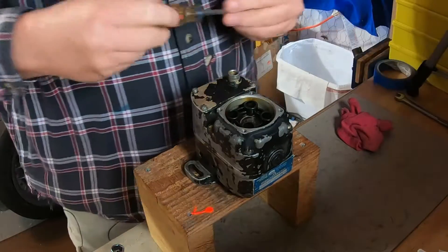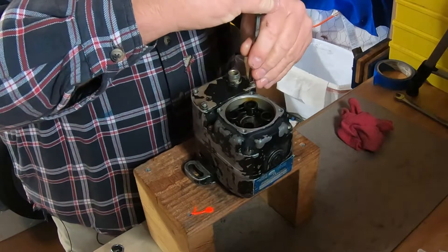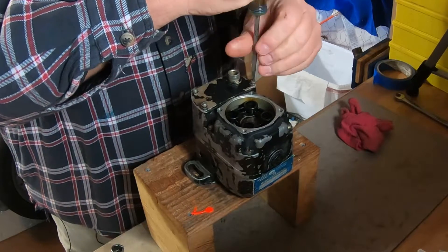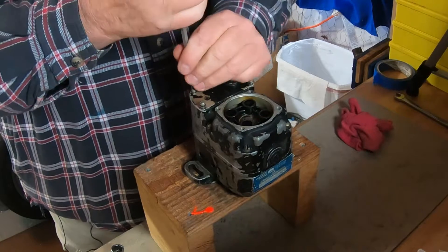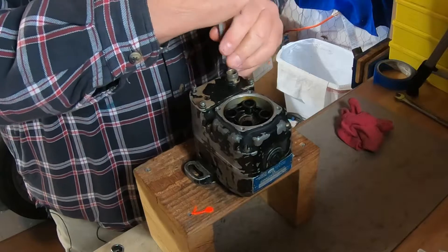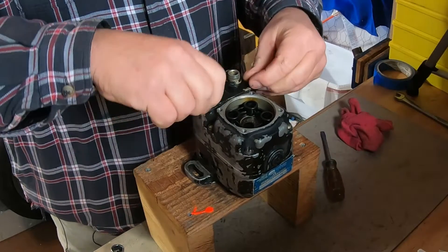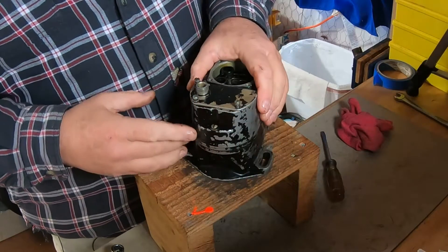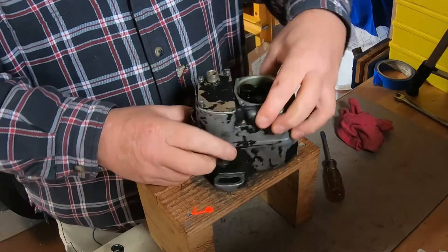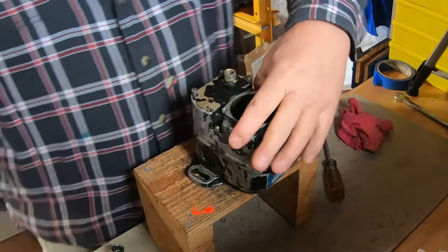Now we can open the breaker compartment and disassemble the housing of the magneto. You're going to find numerous configurations of these. The older ones have vents on them — this is a non-pressurized magneto. You'll find some with a circular vent on the back with a little hood, some with a slotted vent, and some with a P-lead on the bottom of the housing, and then they moved it up to the back of the housing.